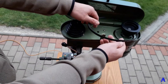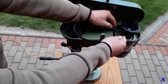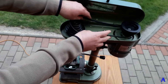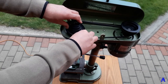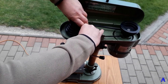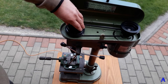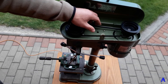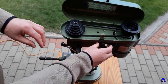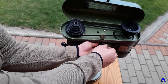To install it, you release the tension screw and push the motor over if necessary — though in this case it won't be necessary. Then place the belt where it should be and use this method to seat it. You can see that even now the tension is way better. You can use it like this, but you can also push the motor a little and tighten the screw for even better tension.